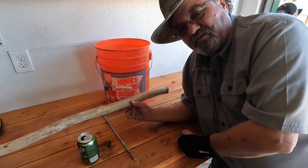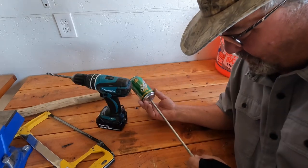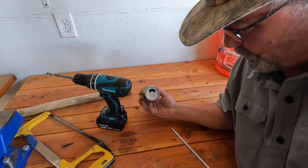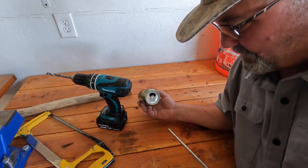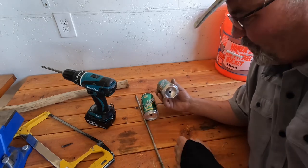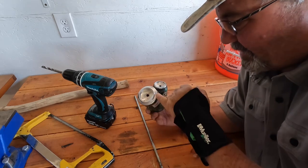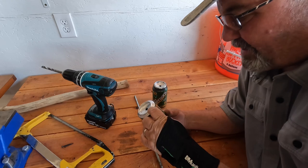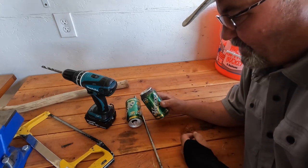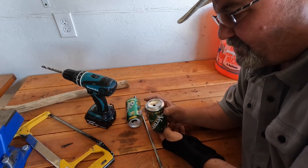The idea is to drill a hole through the center of the can so it sits on the shaft and will turn. There's no great way to drill through the center because of the opening at the top, so I did something different. I took another can, cut all the way around it with snips, and ground it down on my bench grinder so just the bottom remained. It fits right over the lip on the top of the can. I put some JB Weld around it, clamped it overnight, and now it just looks like a can with two bottoms.